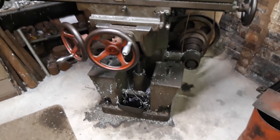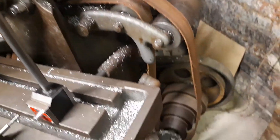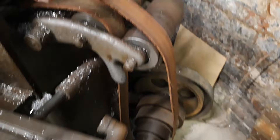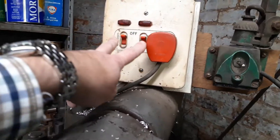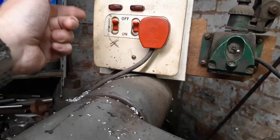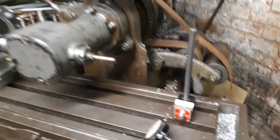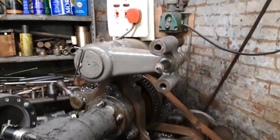This is quite an old Denby mill — it's probably turn of the century. You can see from the way it's driven that this isn't something you'd find in a modern workshop where health and safety is a concern. In fact, to start the machine when the belt's tensioned you have to pull it up with your hand because the motor's a little bit old, and similarly there's no capacitor to start, so you have to flick both switches on and then flick one of them off. It works well — it's not as dangerous as it might appear.